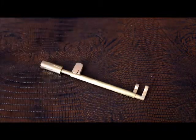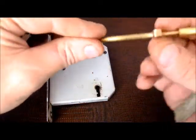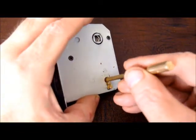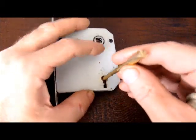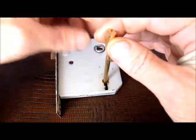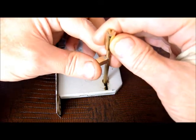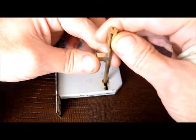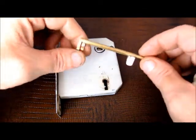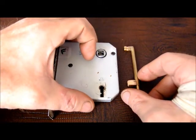So that's basic construction. At the end of all of that, you basically end up with the tool — hopefully — that you can take and fit inside the lock. You can twist the central part to catch onto the latch and use this outer section to interact with the levers. There's a little bit of filing at this point to make sure everything is smooth and everything is going to fit as well as possible, but it's time worth spending.